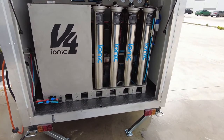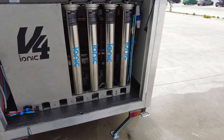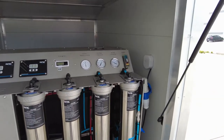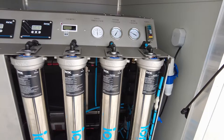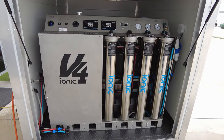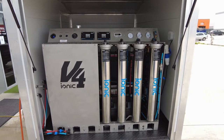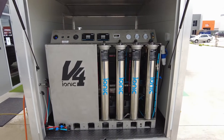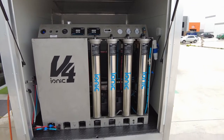It does have a battery in the back. We've put a 120 amp hour battery in the back so that drives the two pumps, and that battery is charged by a CTEK charger in the top of the unit. That CTEK charger is powered by 240 volt to keep that battery topped up through the day. If this was in a van, a split isolator when the van is operating would also keep that battery charged. So it is reliant on you plugging that in daily to make water and run the CTEK charger, which is all automated.